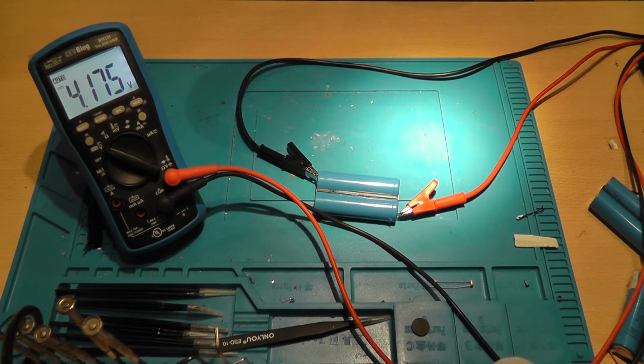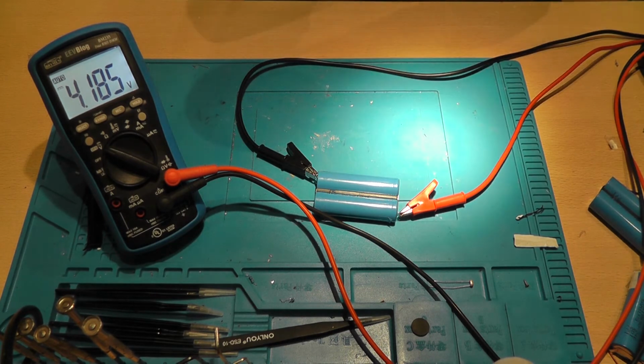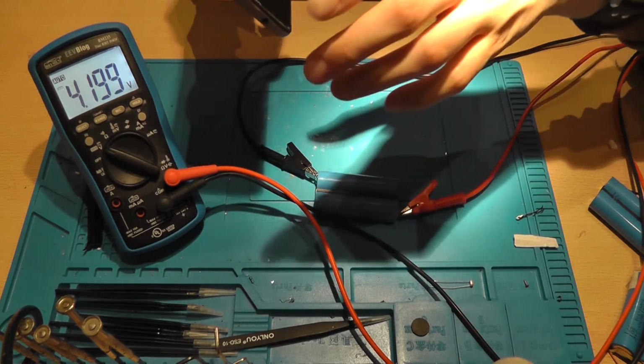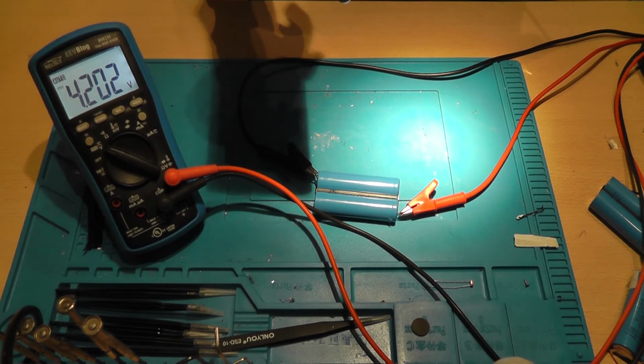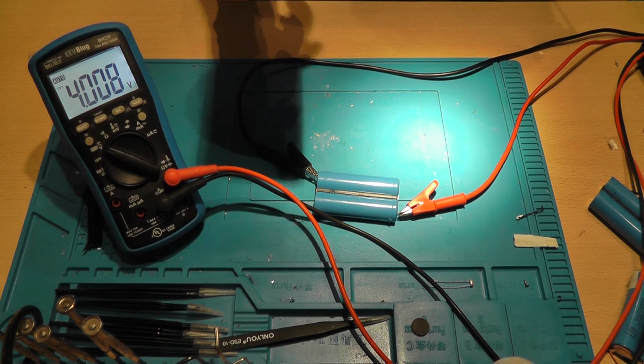So you see the current dropping on the display. That means that the battery is charging. You can see it's around 4.54 volts at the output of the power supply, but it's around 4.2-ish volts at the multimeter. So now it's at this voltage, and that's the time you need to slowly decrease the voltage. Oh, it's got some kind of threshold or something, because now the current drawing drops to virtually nothing compared to the previous state.